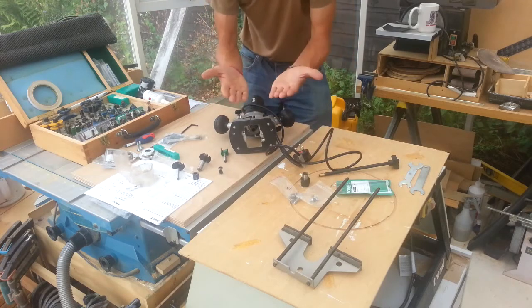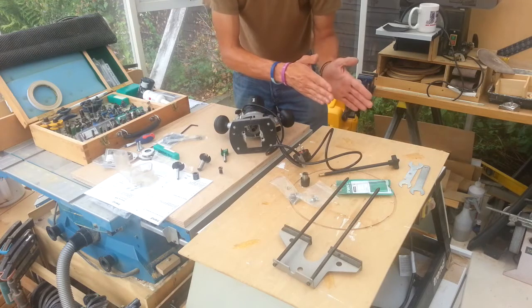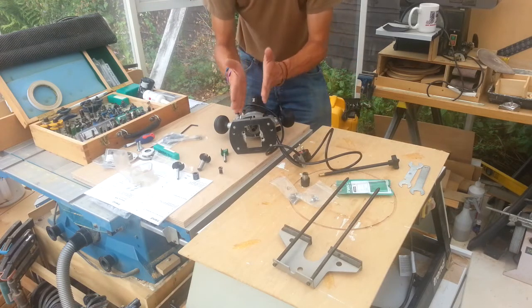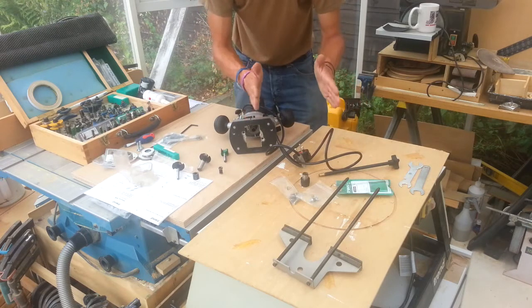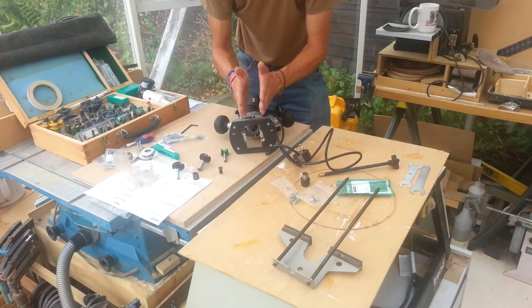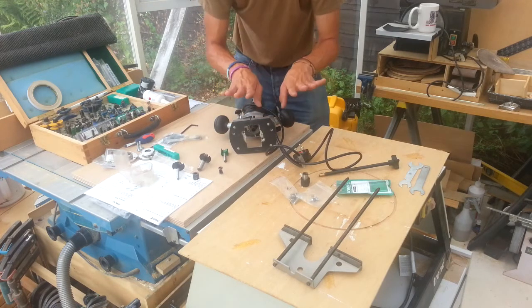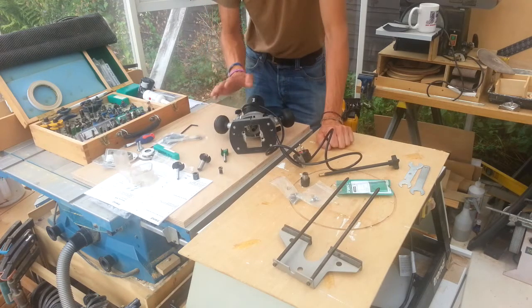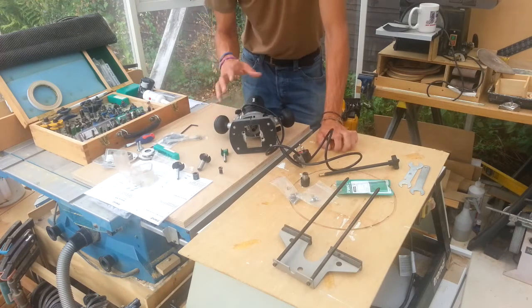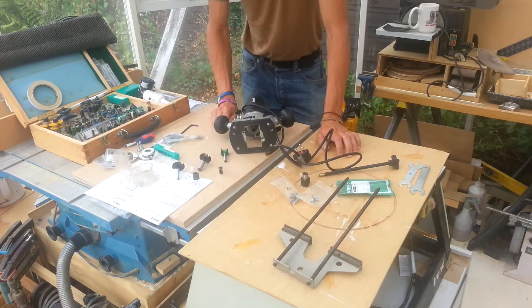And you'll find when you look at the catalogues and the vast array of cutters available, the smaller shank bits will only go up to a certain size of cutter, whereas the half inch bits will usually only go down to a certain size, and they kind of overlap in the middle somewhere. So that's a consideration. Are you going to be using big bits or little bits in terms of cutters?